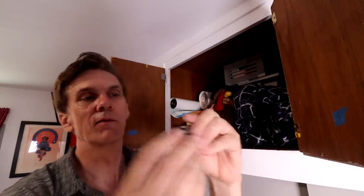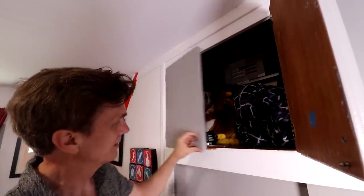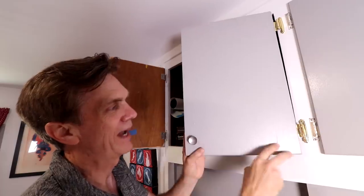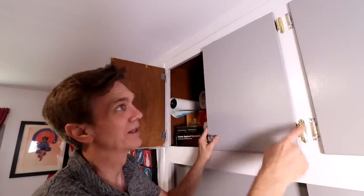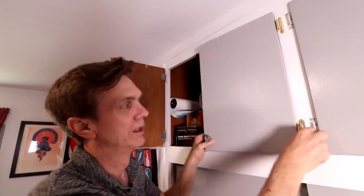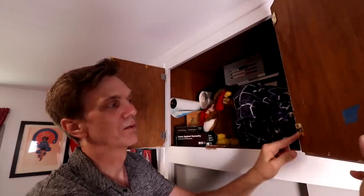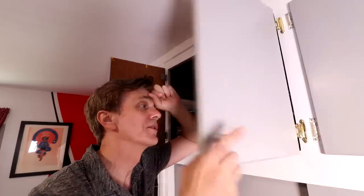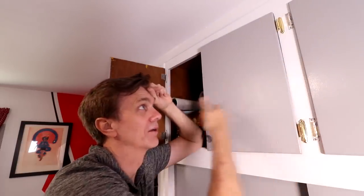They split apart because they don't fit right — it's always a horrible fit. There are these little pressure fits that go into a little bitty knob and it's supposed to snap in there but it never works right. I've replaced these hinges in the past and tried getting new hinges. The problem is all the screw holes are now too big — they're stripped. I'd either have to fill those with little dowels, sand them off and re-drill, or get new brass screws for all of these hinges.